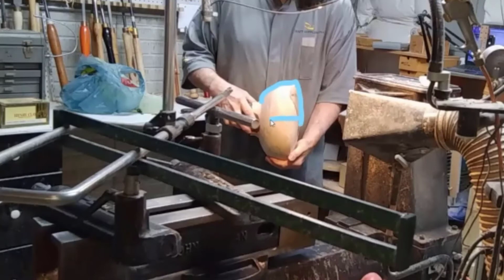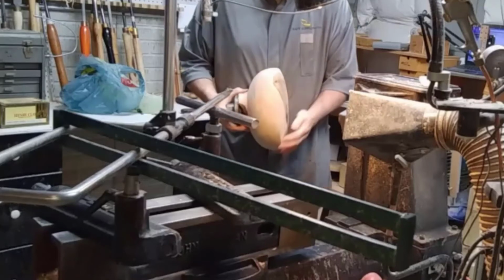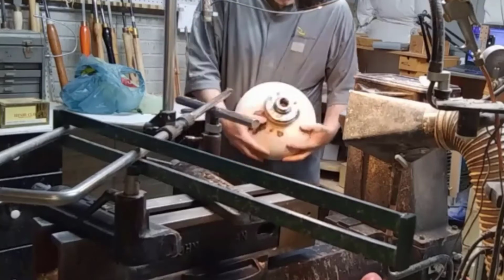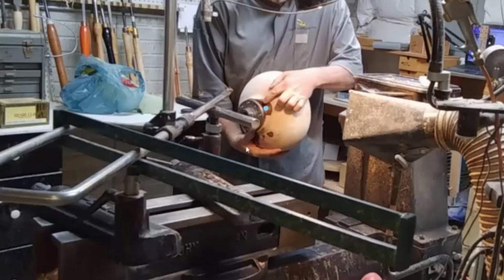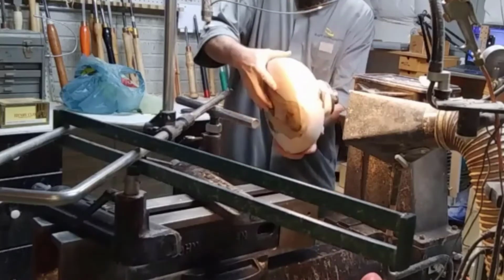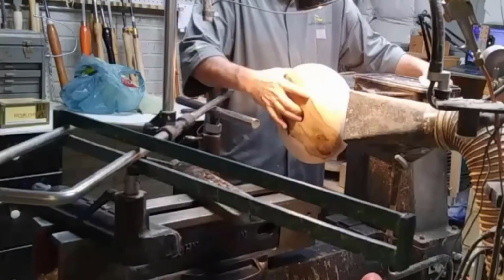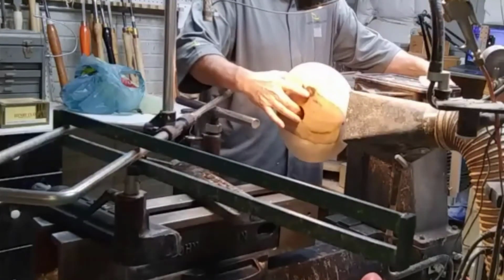And I've drilled a hole down to about here. Now this piece has a big branch, a rotted branch going through the bottom, and it comes out two places there, right here. And you see it came out here, and there's a relatively big void right here. And so no way was I comfortable using a chuck in that condition, so I used a faceplate on this one. Faceplates are really nice. You should probably start with a faceplate anyways, because it does reduce vibration compared to a chuck. You just have to plan to make sure you don't cut into the screws that are used with the faceplate.